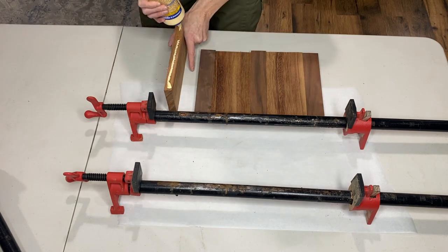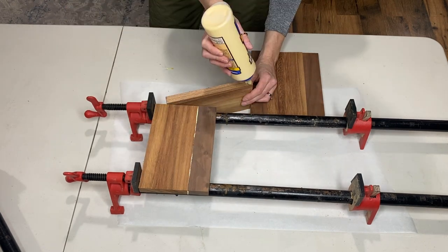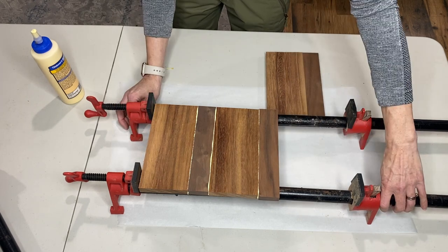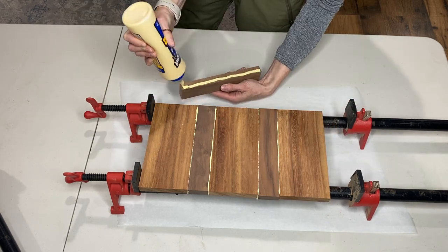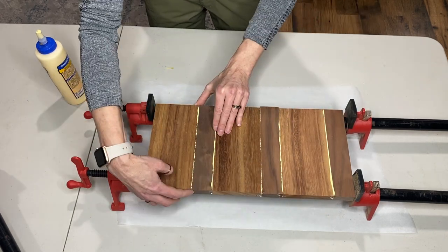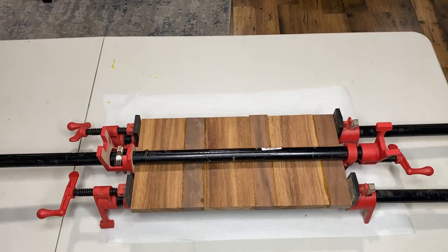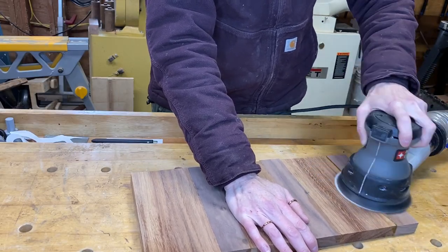I cut all of these just a little bit over eight inches. Now on to the glue up — you can see I have kind of a wide and skinny look here, and I really think that that's going to add to the aesthetics of the board, give it just something different than what you normally see. You can design yours however you want by using different wood or just changing it up in some way. I'm going to put a clamp on the top just so that the board will stay flat and not bow. And thanks to the power of editing, the glue is dry and we are moving on to the sanding.